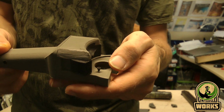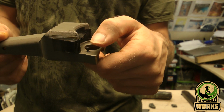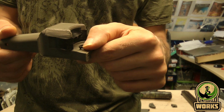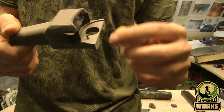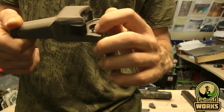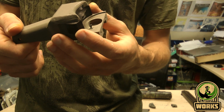The magazine activator is a little screw. At first I wanted to go with a 3D printed pin, but I figured out pretty fast, and in hindsight it's really logical, with layer lines and things like that, it's kind of delicate. So it's way better to just make a hole and thread in a piece and a bolt at a certain height. It will also be told in the documentation. So yeah, it's way stronger to use it like this.